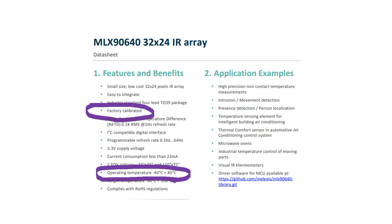I found a sketch by M5Stack which uses this sensor to create a thermal camera. Total cost? The M5Stack costs $30 and the sensor $70, making around $100, with PLA and the bigger battery not included. The code from M5Stack did not work correctly. After a lot of investigation, I found that I had to change one parameter from 7 to 0 — the wire library signals its acknowledge with a 0, not with a 7. I also discovered that the temperature shown in the middle of the screen did not work correctly. Both are corrected and you find a, hopefully working, example on GitHub.